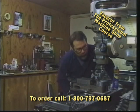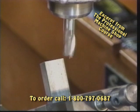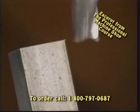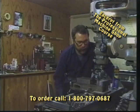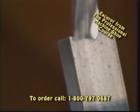Bring our cutter down. We're going to lock the quill down. We're going to index the cutter just over the edge of the part. We're going to raise the mill bed until we've just come in contact with it. Back the cutter away. We're going to take about 50 thousandths of a pass. Very gently advance the cutter across the part.